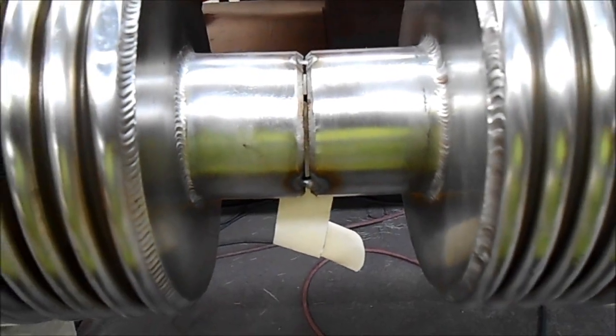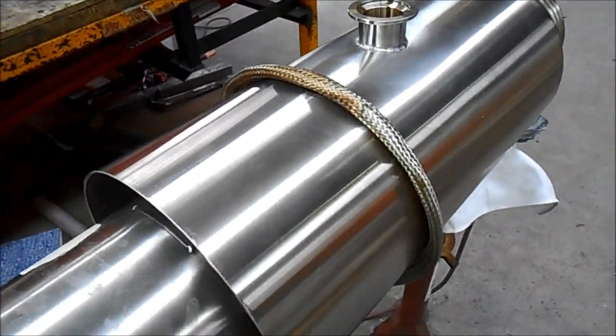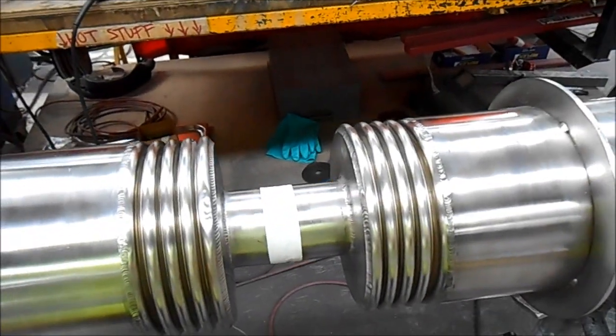This is a close-up of the tack joint. Welders then butt weld the ends together. Note how the sleeve has already been slid on — this is particularly important with elbow spools.